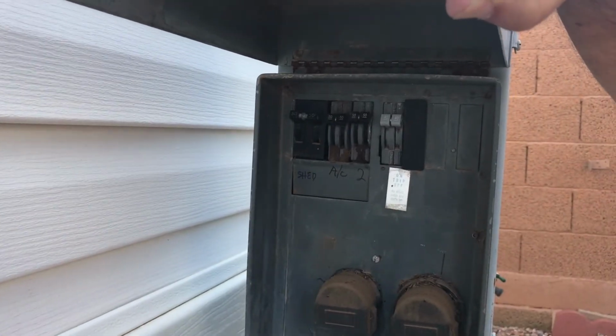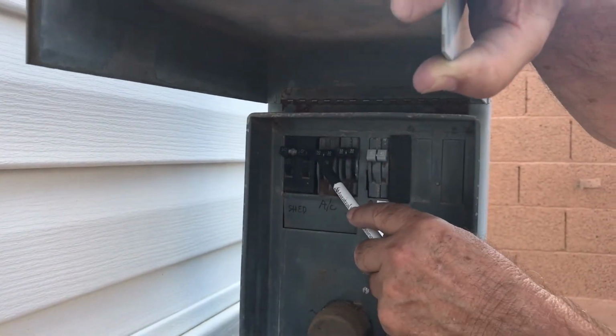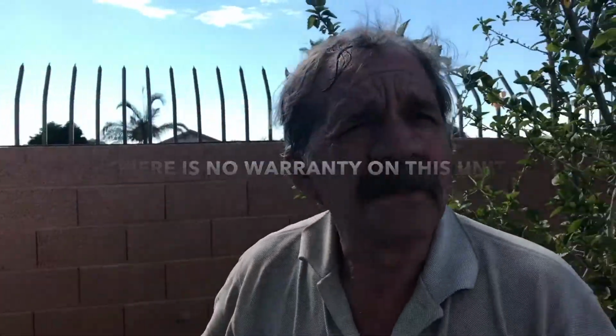Okay. On the manufacturer specifications on the panel on the unit, it says maximum 35. So I am recommending this breaker be replaced with a 30 or 35 amp, because basically the biggest thing is, if you get an extended warranty on it, they can void the warranty because it's not wired to the manufacturer's specifications. Okay. So we just get an electrician to replace it with a 30 or 35?